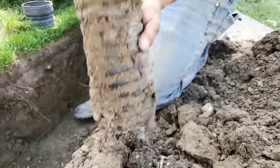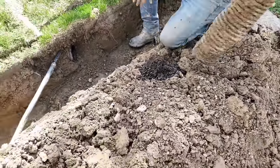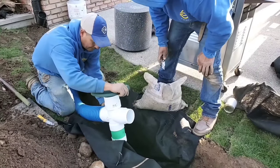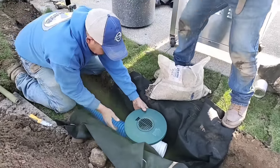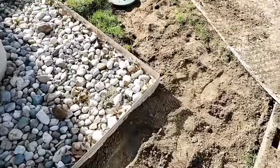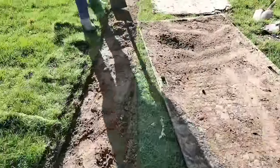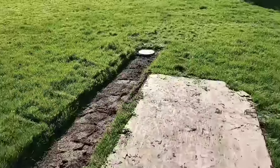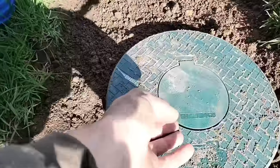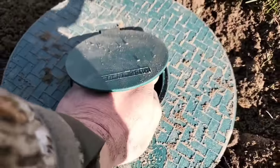We see it all the time, so this is why we put in all that extra effort. We put in those inline catch basins that can fill full of shingle gravel — it's super easy to just take the four-inch grate off and put a shop-vac in. We do the cleanouts up at the house so it's super easy to put a garden hose in and flush the system clean. We go so far out into the yard to get the drop we need so everything runs clean through the system, and of course a pop-up you can get your hand down in. If you found this information helpful, please give us a thumbs up — it supports the channel. Leave any questions in the comment section, and until the next video.